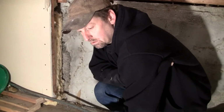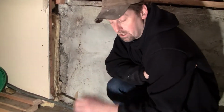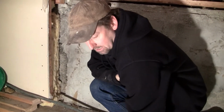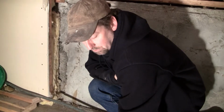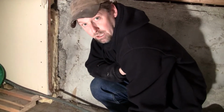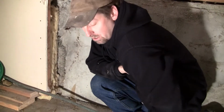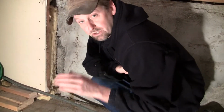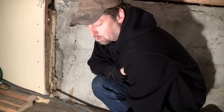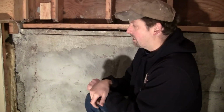Even mastic and tile, you're always going to have a moisture issue. A lot of the old homes didn't have a vapor barrier. This one does have a minimum vapor barrier. So the solution in the Mike Holmes book is no vapor barrier and no sealing, as in an epoxy sealer or anything like that. Just 1 inch of foam right on the concrete, isolating the floor from the concrete. Then the 5/8 plywood, tongue and groove, on that surface, Hilti-ed or attached to the concrete right through, and then you can go ahead with your floors inside. That isolates flooring products from the cold and eliminates temperature differences, which create moisture problems.